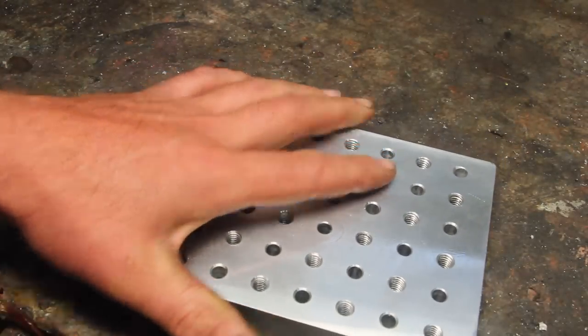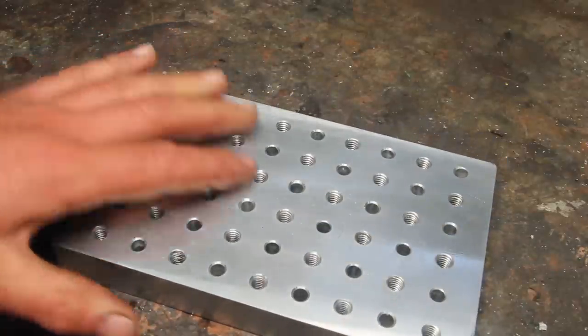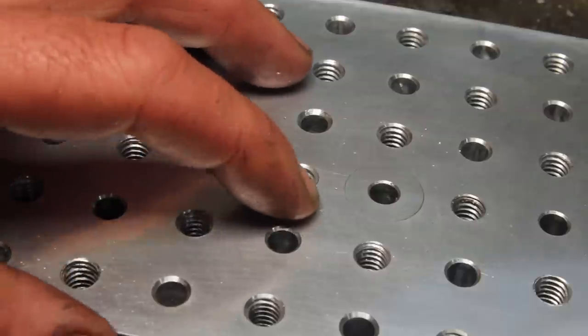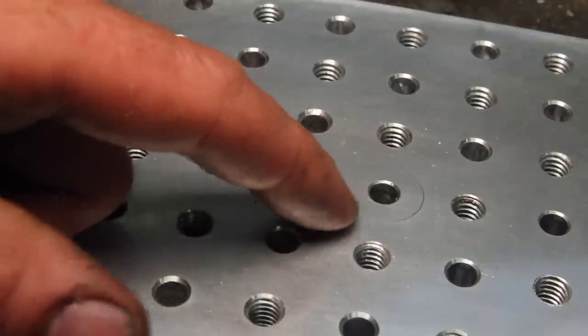I went off on a bit of a quixotic quest with the shaper to get a good surface finish on this, and I never ended up doing it. Eventually I went to the fly cutter on the mill, and that worked out pretty well. It's not spectacular, you can see some porosity there. A little repair there is still visible, and that actually has a lot better surface finish.